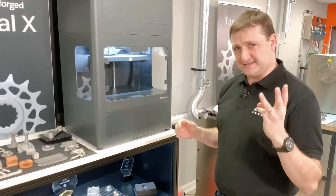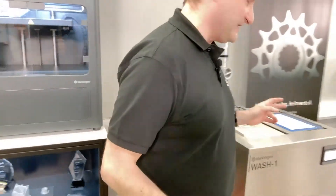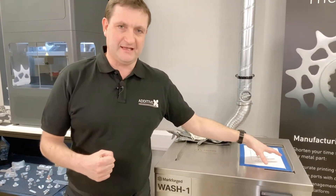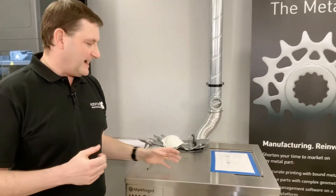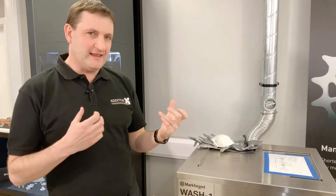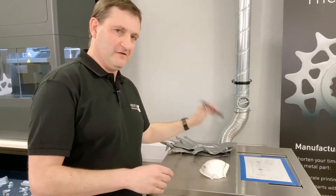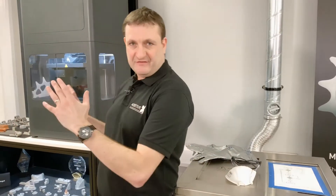As I mentioned, it's a three-part system. We've got the Metal X printer, and then we've got the wash system. The wash has a de-binding fluid on one side, and then a drying station on the other side. The ventilation is just for hot air coming out of the cooling system. It's very light on PPE because we're not using loose powders. For the wash system, we have a face mask, goggles, and gloves — that's the PPE required. There isn't anything actually required for the printer itself, as we're not dealing with any loose powders.